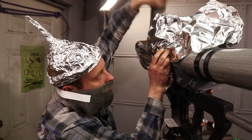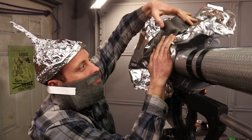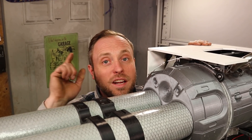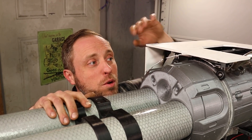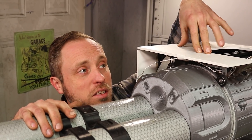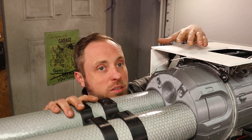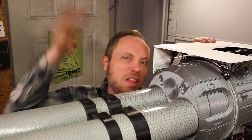The limit switch wire problem was not an easy fix. I tried all sorts of different shielding methods to keep the EMI from going into the wires — aluminum foil, steel wool, combinations of the two, different routings on the frame — but nothing worked. The only way I could get it to stop was to move the wire as far away from the frame as possible. So I rough-cut and installed the panels that are going on here anyway and taped the wire in place, so it would stop freaking out and thinking the lid was flapping open and closed.